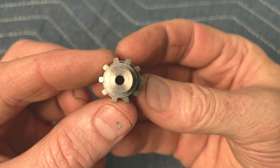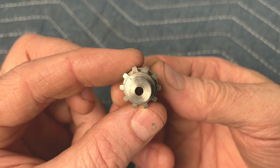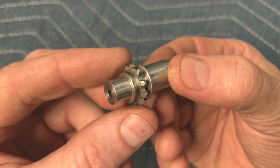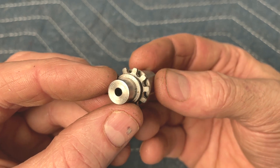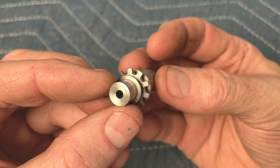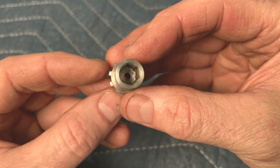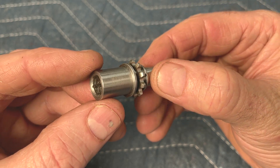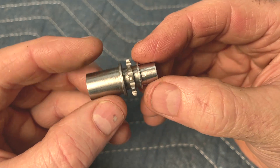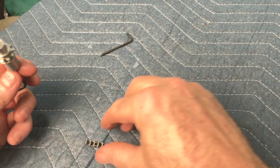There are a few positions where it cut a little bit too deep, but I think I can prevent this next time by using some shims between the indexing plate and the base plate. I'll just have to do some measuring with the indicator so that I can locate and correct the runout. This spindle was just a proof of concept part anyway — just a practice part. It's not going to be used in the finished tool. I'm probably going to make a few more sprocket blanks so that I can test different dimensions and tooth profiles to see which one gives me the best interaction with the roller chain.